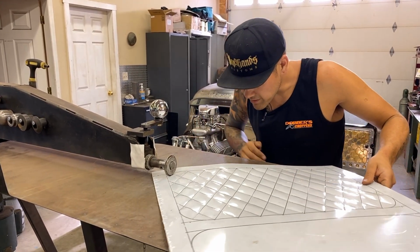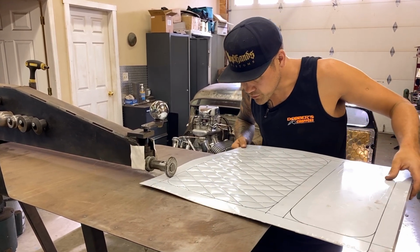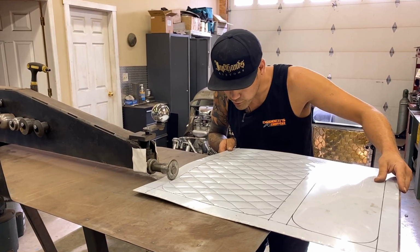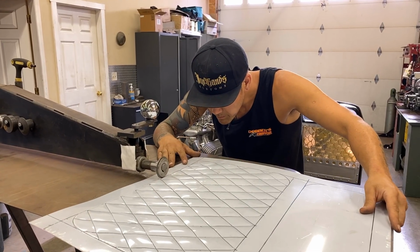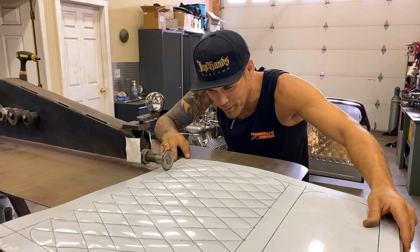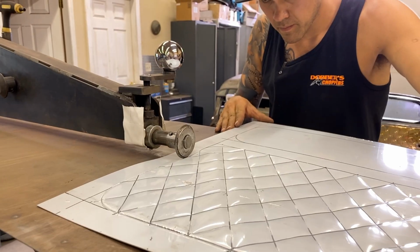It's gonna be nice and smooth on the corners. Try not to be jerky. If you fall off your line, try and get it back nice and smoothly. Don't just jerk it back because you'll see that. I've also kind of had to learn to be smooth because my bead roller doesn't slow down. Doesn't slow down for nobody.